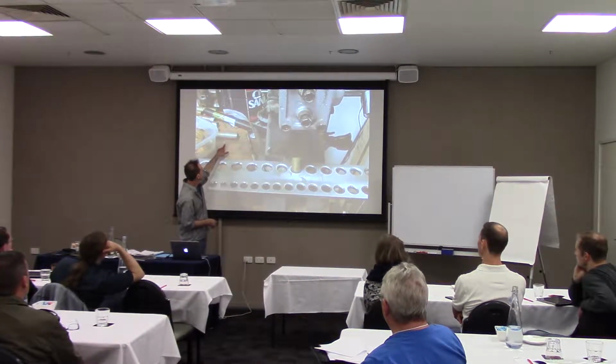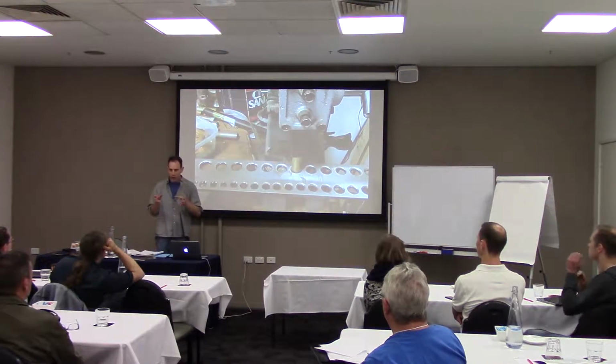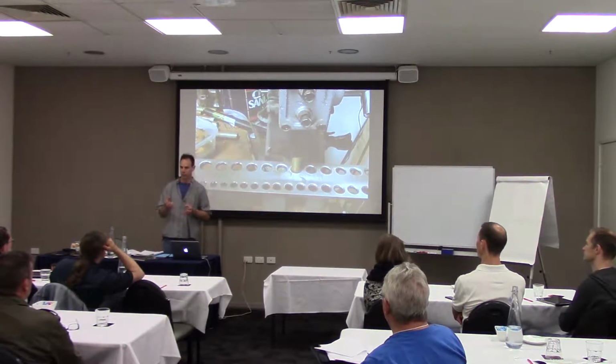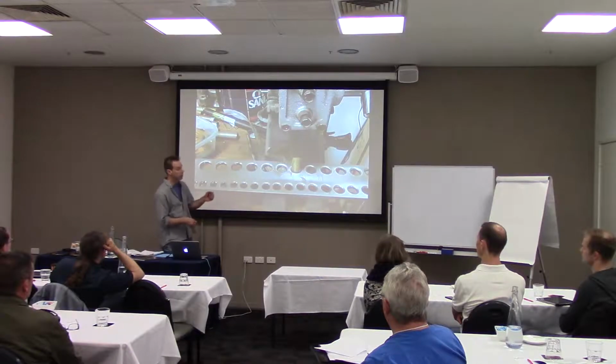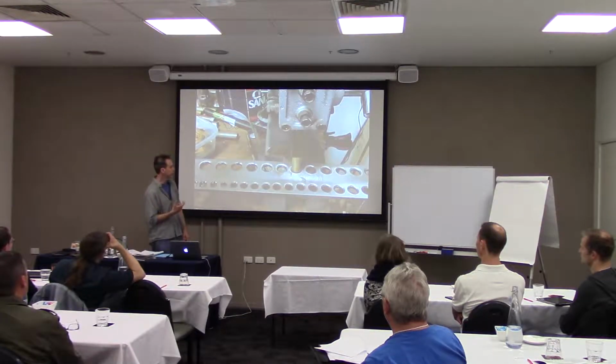This is nickel tubing here that I use. You can buy it from Cervini or whatever, and I draw that down because I do a lot of trombone conversions. Bach will sell you some things, but you can't get outer slide tubes, so you have to make those. So I use tuba tubing, anneal that, and then draw those down through the presses. When you're drawing tubing, make sure you don't heat it up bright red cherry hot. That thing's going to collapse on you. You want to just do it dull red, and then use a lubricant, a wax or some sort of burr life, and that'll help with the drawing process.